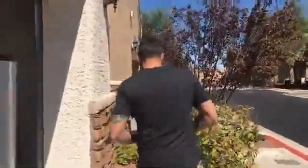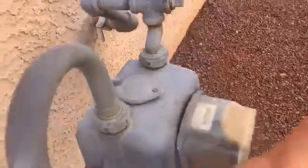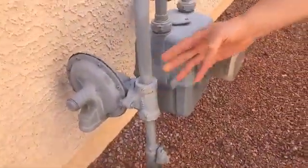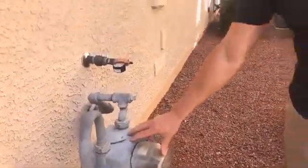We're going to go over here to the gas line. The gas line is usually on the side of the house. This is what your gas meter looks like — this is the city supply side and this is the side that feeds the house. This gas regulator basically regulates the gas pressure coming into the home so it's safe to use. When installing a tankless water heater with a higher BTU level, it's common that we have to upsize the gas line.